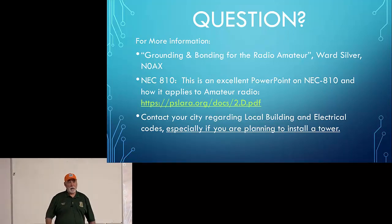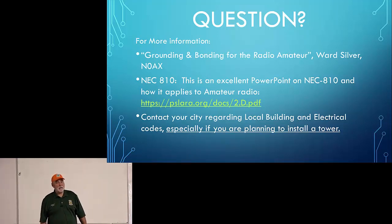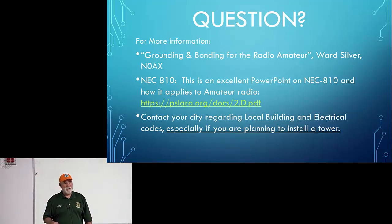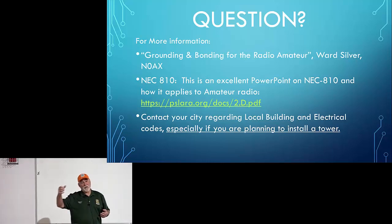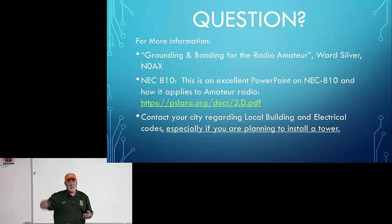Now on 160 meters, 200 feet of coax, there's no loss there. 200 feet of coax at 450 megahertz, that's a whole other discussion. That's why up on a lot of the repeater sites, we use Heliax, where the losses are really low, and if you've got all kinds of money to spend, then you'll use LMR 600. I looked at half-inch Heliax compared to LMR 600, and the LMR 600 was actually a little bit lower in loss. Of course, you could always go to 7/8 Heliax if you've got a really long run. On Mount Ogden, Scott, correct me if I'm wrong, our worst case scenario is about 90 feet of LMR 400, and I think we're using the UltraFlex. I calculated the loss, and it was roughly 1.5 dB.